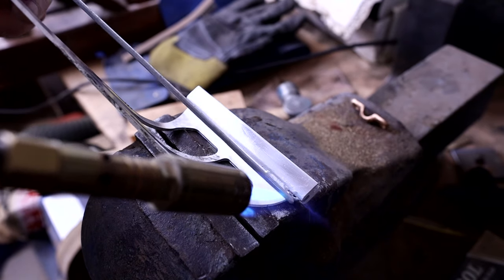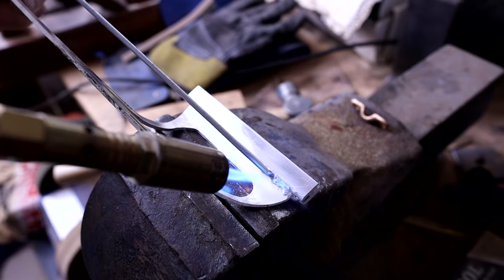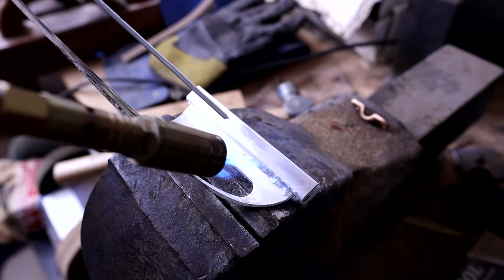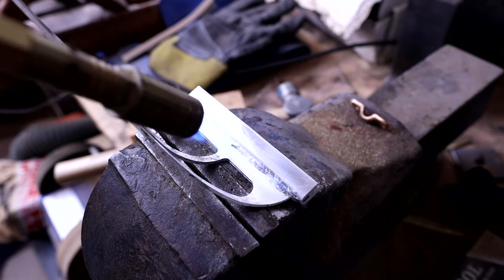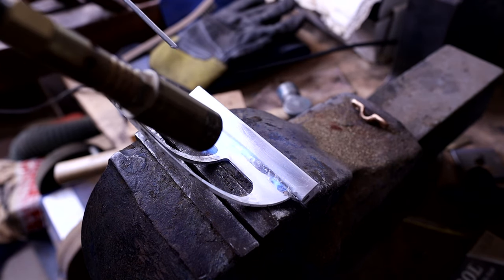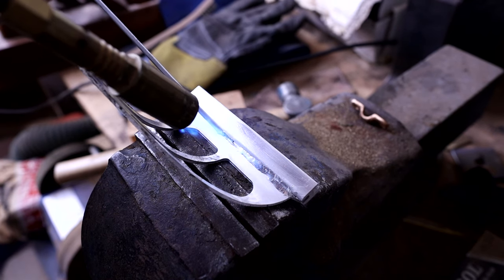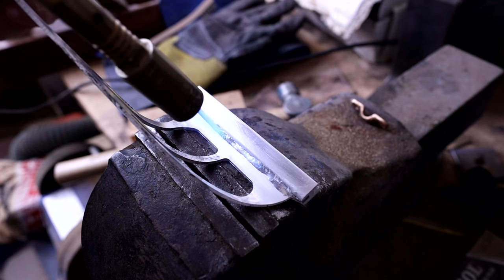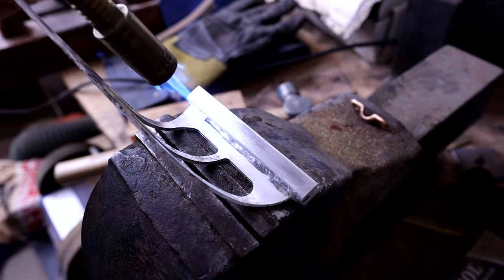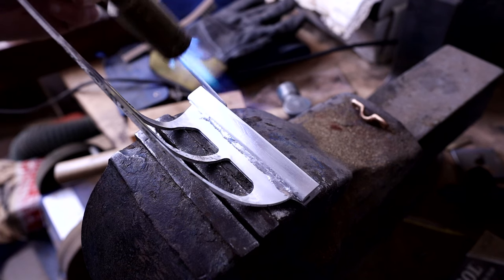You basically just brush off the surface of the aluminium with these little stainless steel wire brushes, and that just takes the oxide layer off the top of the aluminium first. And then you heat that up with a standard propane torch and you just flow in the brazing rod, very much, as I say, like the way that you would solder something. And you can almost use it like a filler actually, if you can just sort of feather that heat in and out. You can just fill in tiny little sections and use it for filling.